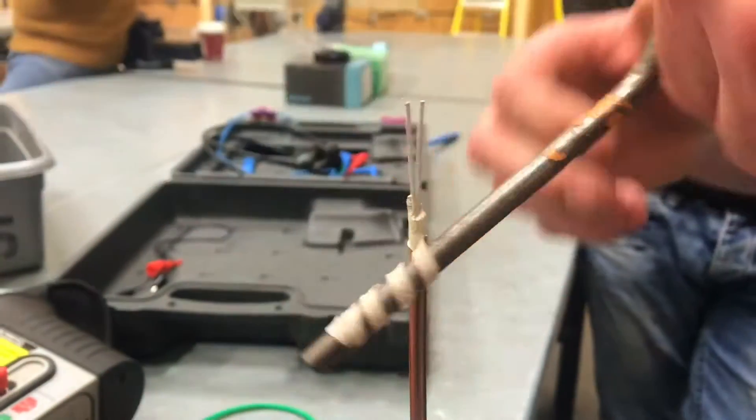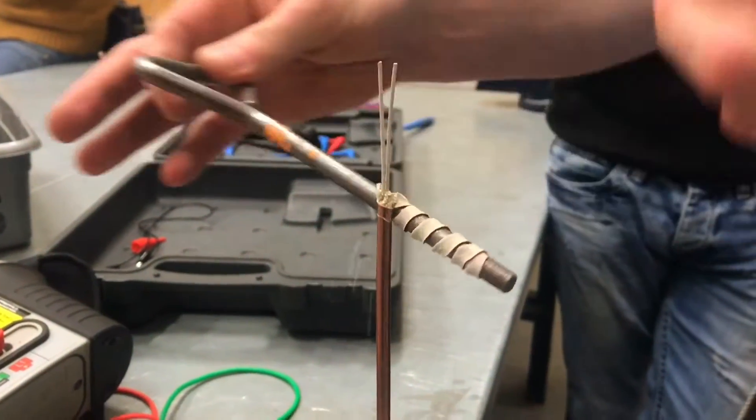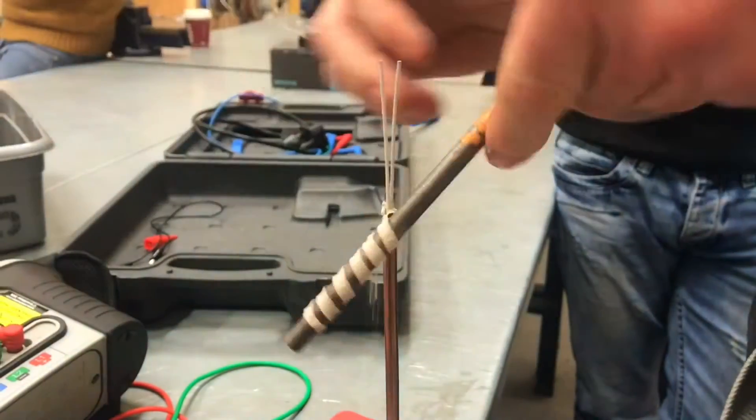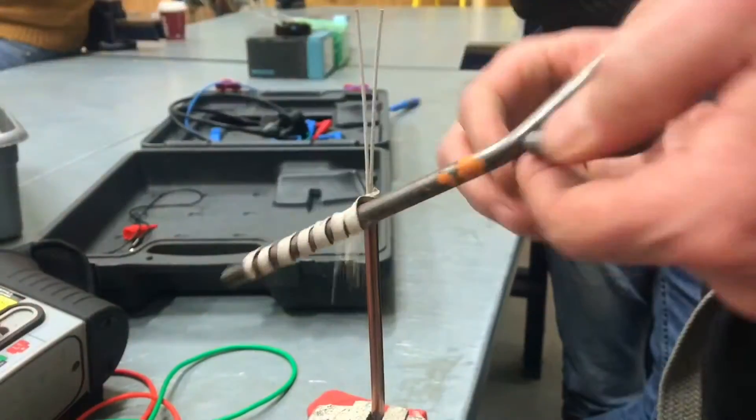So as we turn it, we're turning the key — we're not dragging it. And as I put the pressure on it, we can see it's stripping the mineral insulated cable. We're still trying to keep the conductors really straight. And if I go deeper down, I can get a bigger swathe, but I'm turning the key — I'm not dragging it round.